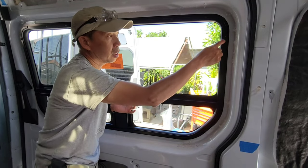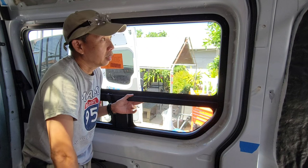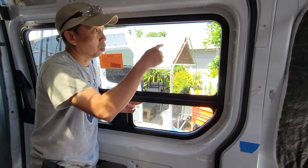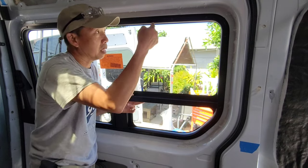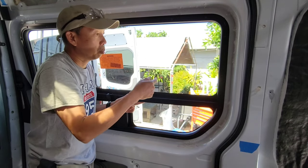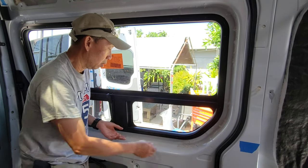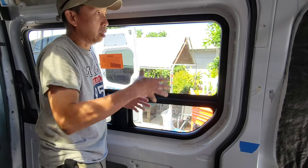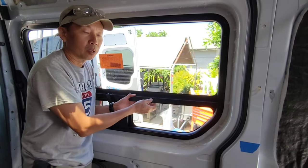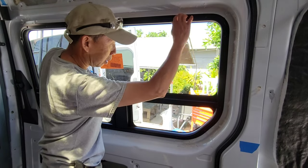Pre-drill the pilot holes for the screw holes. It makes things a lot easier when you put it up rather than trying to drill the screw into the frame up there — there's a chance you might slip and hit the glass. It's best to pre-drill the pilot holes beforehand. When you come up here it goes in much easier, and with the height it's kind of hard to put pressure on the drill and keep it stable. Better to do it when you have it on a table outside. It comes out really nice.